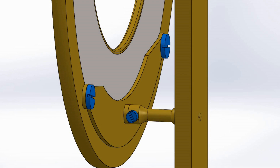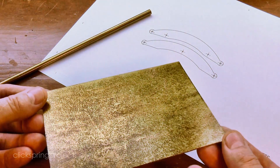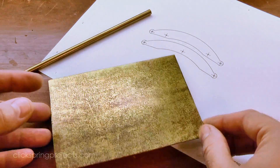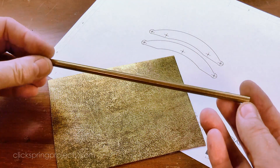I can use the same bezel screws as before, and having something between the screws and the bezel acting as a washer removes the risk of scoring the bezel as those screws are inserted. For materials, I've got some 1mm brass sheet to make what I'm calling the dial brackets, as well as some ¼ inch brass rod to make both the dial feet and the pillars. So let's get started.